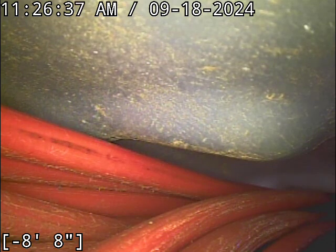But when you get a lot of grease build up in your line, it acts like glue. And that same blockage that might break loose after just a few feet of pipe filling up behind it can now withstand, for example, 15, 20, 30 feet of pipe filling up behind it, and it's more likely that a run-of-the-mill toilet paper blockage could turn into an actual sewer event. So it's one of those things you want to try and keep up with, if you can.